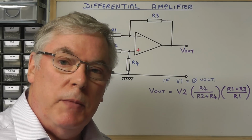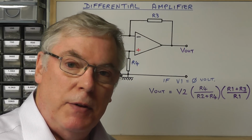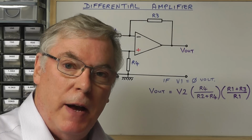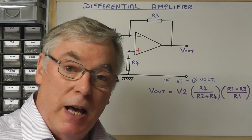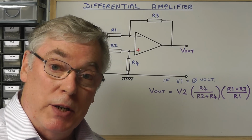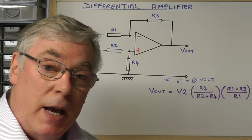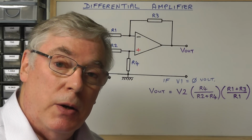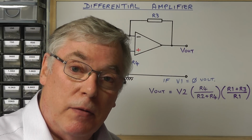So in order to overcome this issue we have with the resistance of the cables and the resistance of the tracks on the PCB affecting our reading of the load voltage, ideally what we need to do is sense that voltage directly on the load itself with separate wires in which no current is flowing through them. And we have to do that in the context that the sensing circuit we're going to use is using the same ground potential as the load itself.